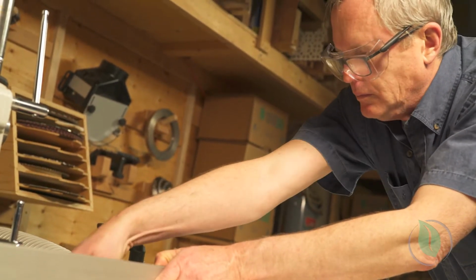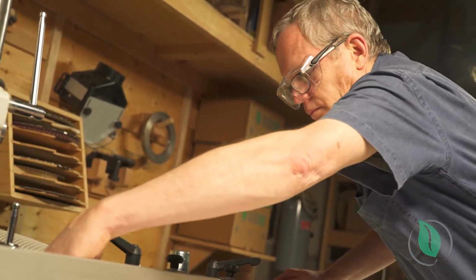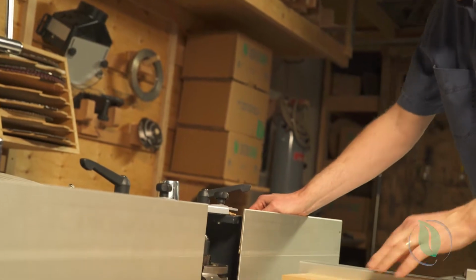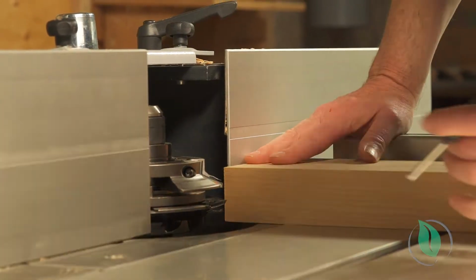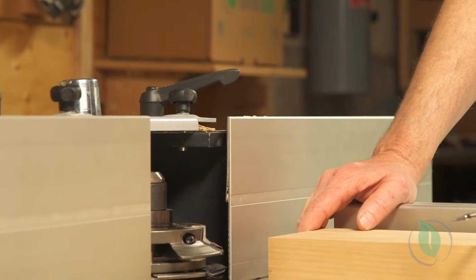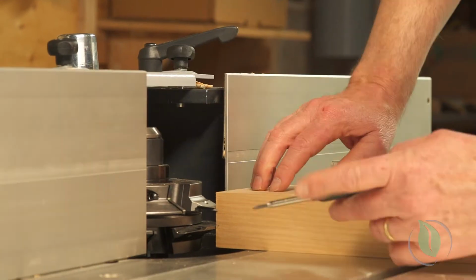I would suggest about 1/4 inch rearward offset of the left side outfeed fence to make sure there's enough clearance from the part. Move the fence sections in horizontally to give about 1/4 inch clearance from the tool and rotate it again by hand to check this clearance. Make sure you check and adjust the clearance of the cross slide fence or tenoning jig to the cutter. If you're using an anti-splinter block, wait to fasten it into place until you have checked the cut dimension.